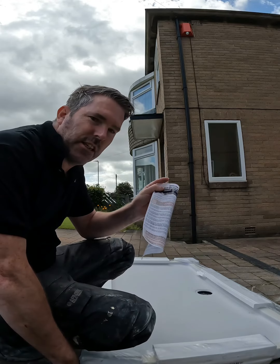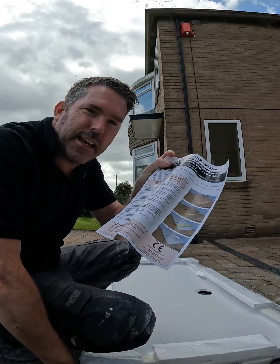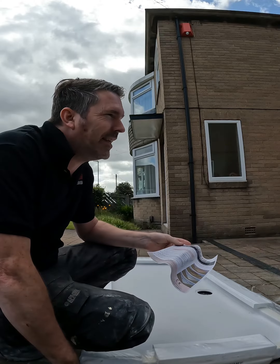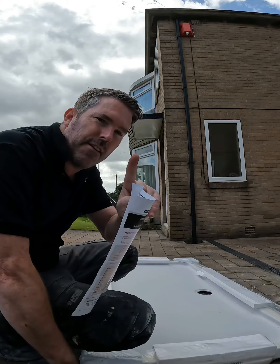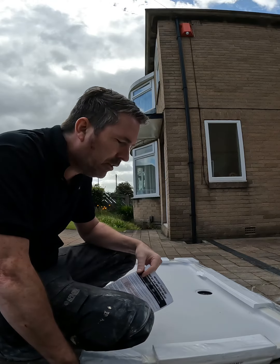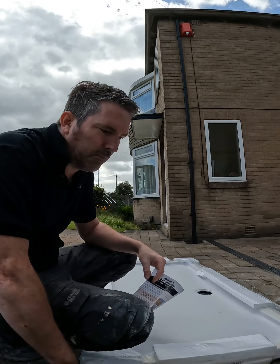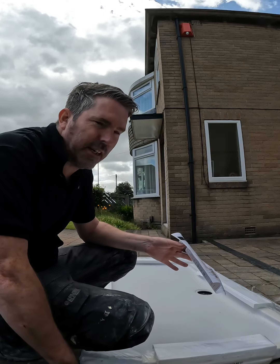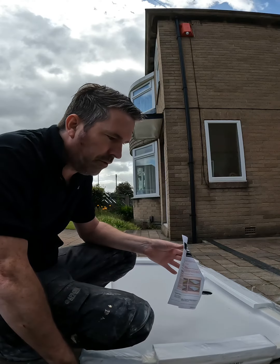These instructions are antique — it's been sand and cement for over 27 years I've been fitting these shower trays and I've never had one issue with any of them. We stopped using sand and cement at least 20 years ago. Sometimes if the floor surface is flat you could use silicone to stick it down, but chances are it's not going to be flat, or you could use foam.